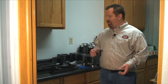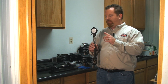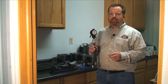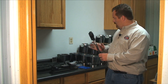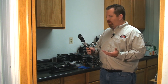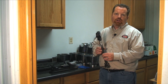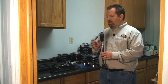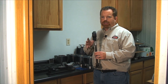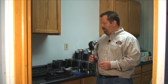The proper way to measure starts with a dial bore gauge — that's the piece of equipment designed to check the size. It gives us the accuracy and everything we need. We use Sunnen gauges here because they're convenient and easy to use. Mitutoyo, Brown and Sharp, and a number of other companies also make good gauges. We've liked the Sunnen just because of the gauge setter system that's involved with it.